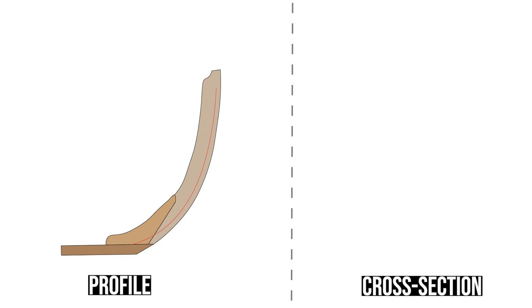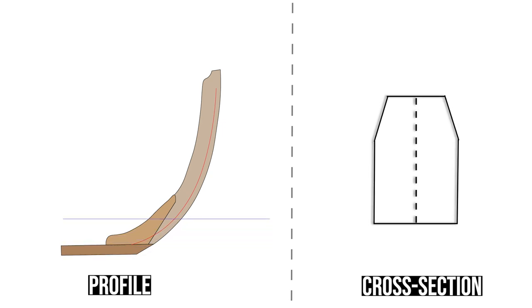The trick is to visualize how the shape of the stem is changing in a continuous manner. Imagine scanning along the stem and watching how the bevel is changing as we move from bottom to top and back again. As we move from the top down to the bottom, the bevel is getting more and more steep; moving from the bottom to the top, the bevel is getting more and more shallow. It would be wrong to assume the bevel is fixed — it's in fact changing continuously. And to complicate matters further, not only is the angle of the bevel changing, but also its width.